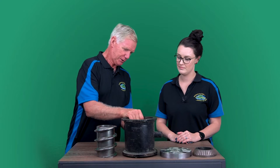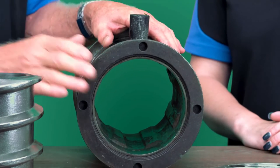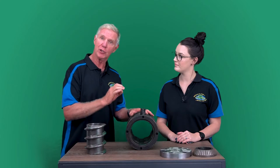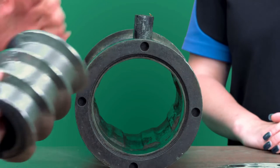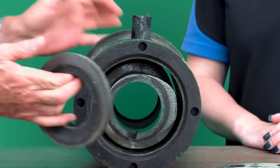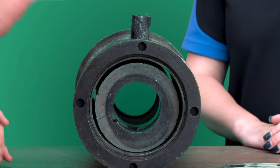In front of us here, we've got some bits from an extruder — these are mechanical pieces. If we take this piece here, this is actually the chamber of an extruder. Up the centre of here is a walloping great big metal shaft driven by a very big electric motor. Onto that shaft we put a flight, and that flight fits in there like so. Then we have a piece called a steam lock, and that piece fits on the shaft in there like so.